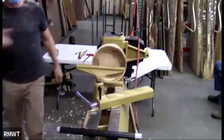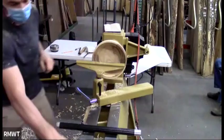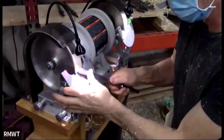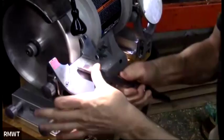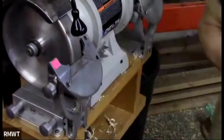I'm just going to make sure I did tighten this up pretty good. Oh yeah, it's pretty tight. Okay, because I'm just going to do one power cut through, which I kept some paper for. Need that in a minute. And sharpen it up. Oh, and I want a 24 inch handle. I want leverage. Okay, so even though this is a 10V gouge, it definitely is slightly dull. I missed a bit of the wing. So got it. And the heel's already pretty short. So a pretty short bevel on this, probably just under an eighth.